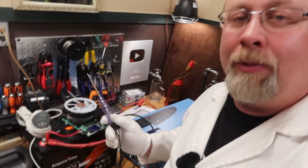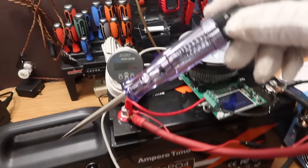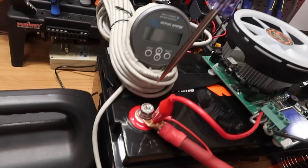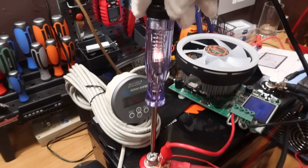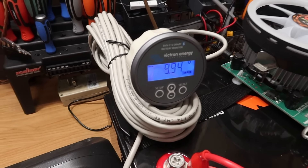You can get these little resistors all over Amazon — they're a couple of bucks. I do have one other method to jumpstart the battery without a spark, and that's something most guys in America who have a workshop or garage already have: one of these cheapo circuit testing lights. These come in just about every cheap mechanics kit for testing electrical circuits like fuses in a car. I have this hooked up to the positive lead of the battery — going to jump it using the tester. There's not going to be a spark because it does it slowly, through the light bulb. And there we go — we're now at 10 volts, enough to get the battery charger to kick in.